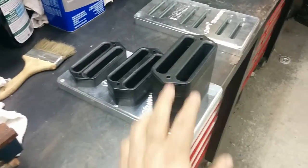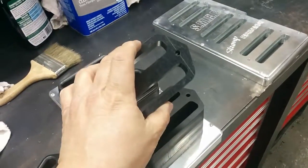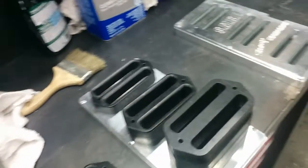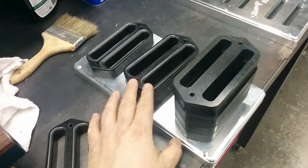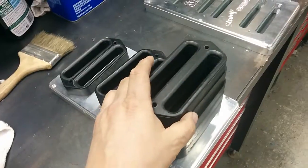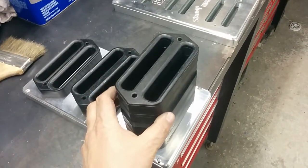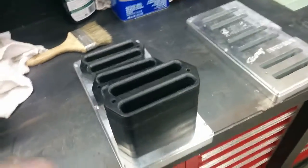So I had to make all of these blocks. The majority of them are just flat spacer blocks, just flat surfaced. And then the outer ones have the corner rounding for flow. That was something I was kind of new at, with all of these various radius corner rounding tools. I haven't used a lot of those in machining, so that was something new for me. The Delrin's fun to machine. It's really easy to machine. It's not cheap, but it's easy on tools and easy on the machine itself. Makes a big mess, but otherwise it's fun.